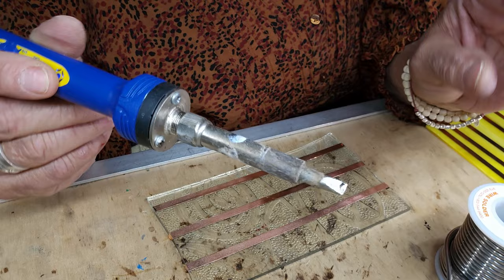A lot of times I'll hold my piece up a certain way so my solder rolls down. Let me tin this real quick — just going to tin it real quick. Turn it around. Then I hold my glass up on one side, and that's going to make a difference on how my solder flows. I'm just putting it up on the top edge, and that's going to give it a whole different look. Kind of gives it a pocket vase look — it's wide at the top and narrow at the bottom. You'll see in just a second how that looks. It's wider at the top and narrows down at the bottom, and it's all because I held my glass up on its edge.